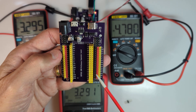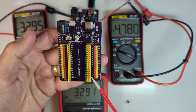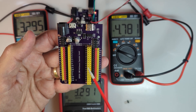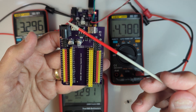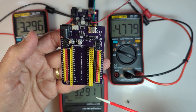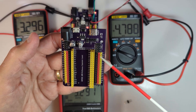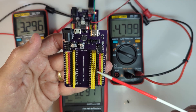Today's video will go over this ESP32 expansion board in more detail than the last video. The intent is to look at the voltages at various pins depending on whether the ESP32 is in the board, the position of the jumper, and whether you're feeding power through the barrel jack or one of the USB connections. Note that you cannot program the ESP32 using USB connectors while it's in the board - you have to connect your USB directly to the ESP32.